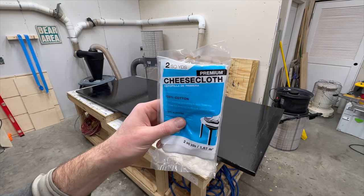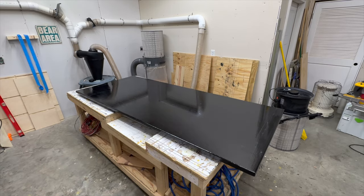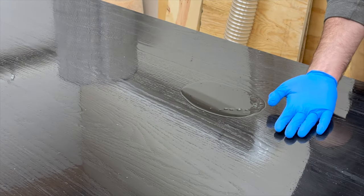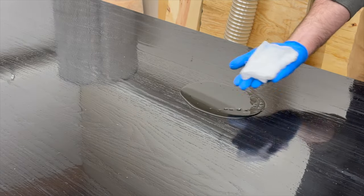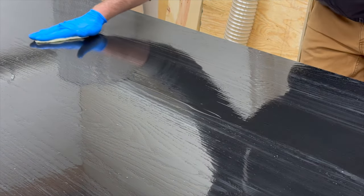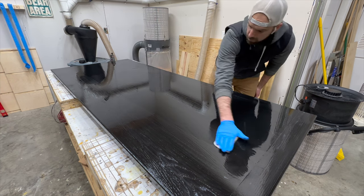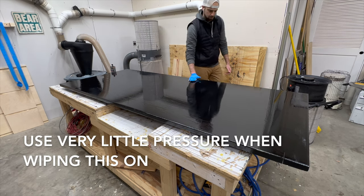Finally, we'll move on to the very last coat, which is the wipe-on poly. You do sand before this coat just like the other coats. For applying this coat I'll be using a cheesecloth. The wipe-on poly is shaken before use as indicated on the can. You want to get a flat surface in the palm of your hand, put that down in a puddle of polyurethane, and just wipe in one constant motion going with the grain — kind of like we did with the stain. This wipe-on poly is quite a bit thinner than the brush-on poly, which is the advantage of using it as the very last step. There is a much lower chance of getting bubbles with the wipe-on finish.